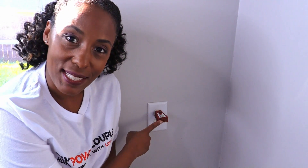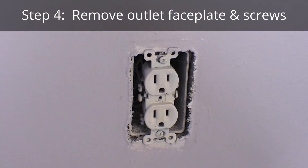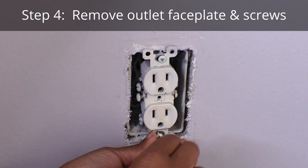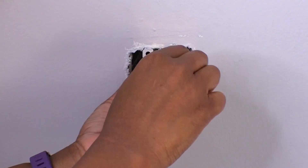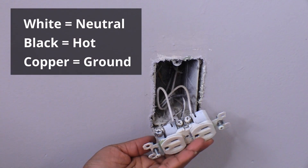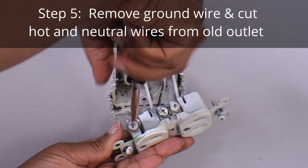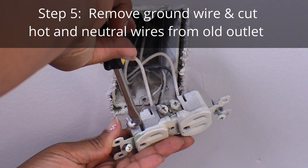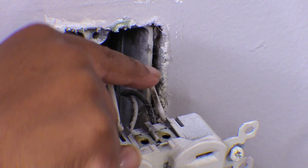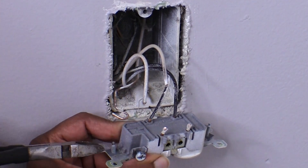So that's good, so we can start with our upgrade. The next step was to remove the screws holding the face plate and outlet. I was a little nervous since this was my first time installing an electrical outlet. When I pulled out the old outlet I could see the white, black, and copper wires. The copper ground wire remained in its hook shape and was much easier to unlatch. I tried to unscrew them but ended up having to cut the white and black wires to disconnect.